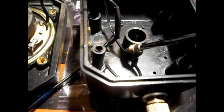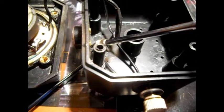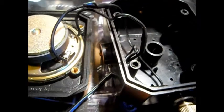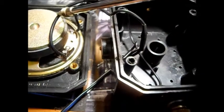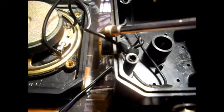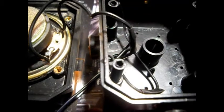We'll do our best to explain this. Here's where the two wires come in from the radio from the plug. Here's the hot one going into the switch, coming out of the switch going over to the positive, which is the top. The ground is coming in and just hooks up normal. Here's the ground side of the speaker going to the line. I have a picture of this knot I made — I think they call it an electrician's knot. That's what you do when you wire a lamp.